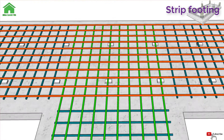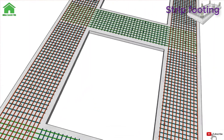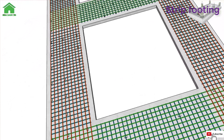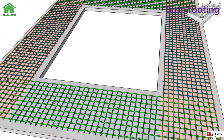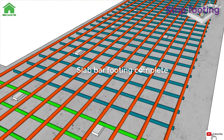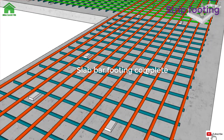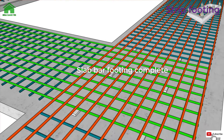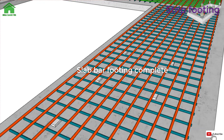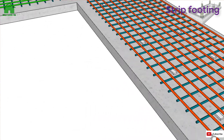The depth of the strip will usually be equal to or greater than the wall width. The footing width is often three times that of the supporting wall width, providing for a 45-degree angle between the wall base and the soil. Strip footings should also be deep enough to avoid frost, while it may be necessary to increase the width when working with softer soil. When needed to support a line of load by spreading the stress points, strip foundation is often the best solution.